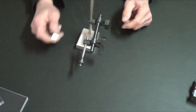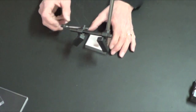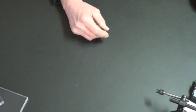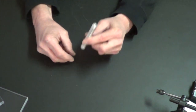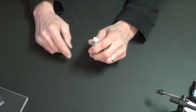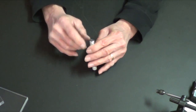I can use any height and any dial or test indicator with this — it worked out great, I'm thrilled with it. Also for tramming the mill, I quickly made a simple holder that goes up in a chuck: the dial indicator drops in pointing straight down, so I can rotate and check tram easily anytime. Simple little project — the face came out nice.